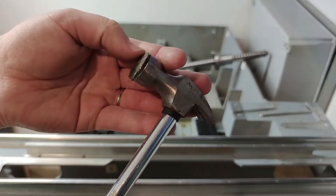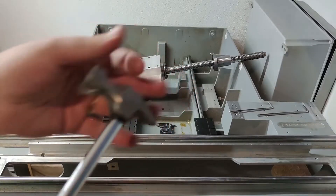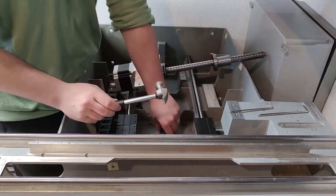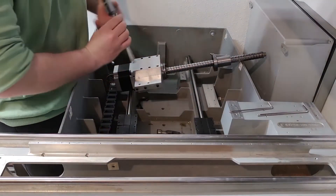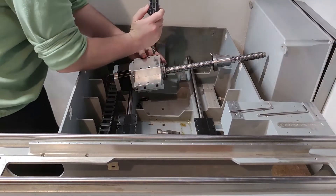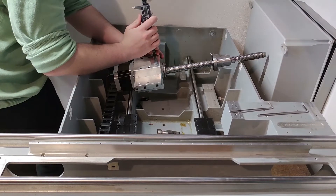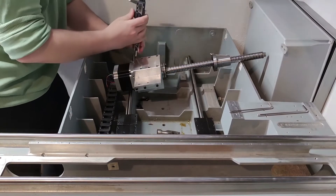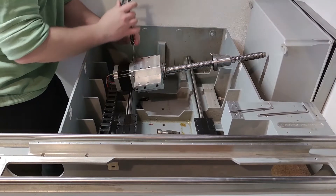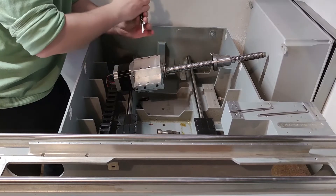I used a cheap hammer with a soft pad on it for tapping things, otherwise I would damage the parts. It was very important that the blocks I machined are mounted very precisely on the motor mount. The critical aspect is parallelism to the upper surface, which is also parallel to the ball screw travel. Of course the ball screw will have to be dialed in with the dial indicator to be precisely parallel to the travel, but that will be done in the final assembly. Here I am only checking roughly with the caliper to get it parallel.